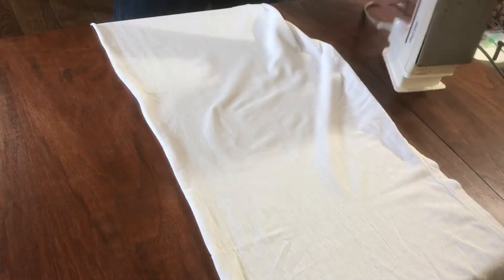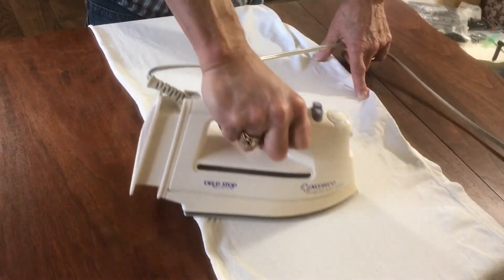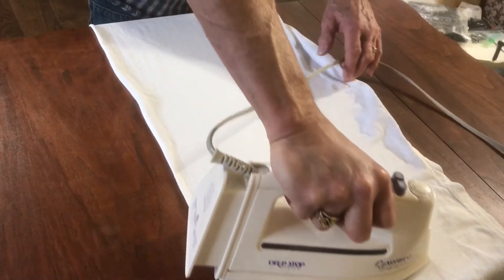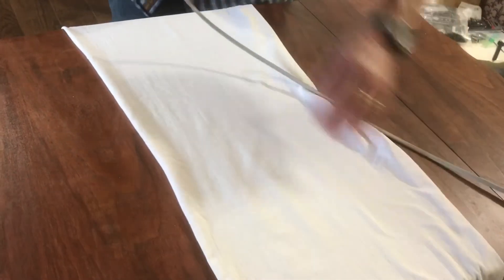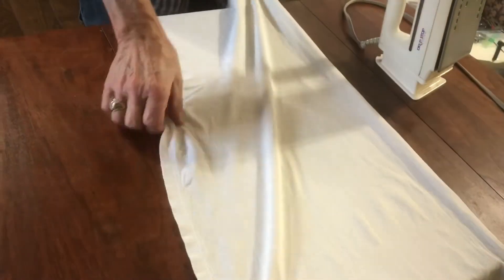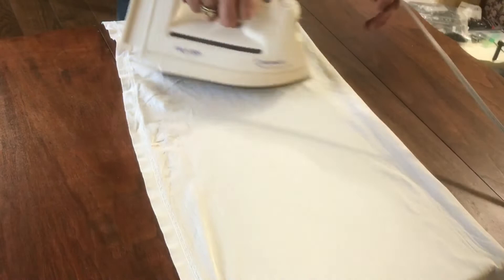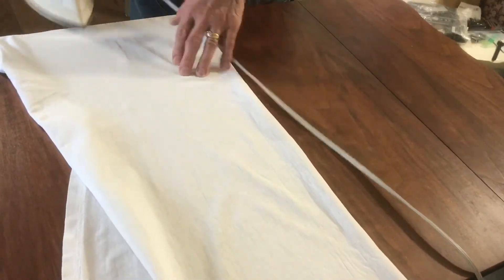So this particular finish can't withstand the heat as much, so I'm going to pick up the speed a little bit. I don't want to remove the finish off this table and have to restain the whole thing — I'm just trying to pull those watermarks out. It's still sticking a little bit, so I'm going to make fewer passes but speed up. There's also a water ring spot up here close to me, and it's already started to lift a little bit. That's about all I'm going to do on this table, and then I'm going to put some lemon oil on it. You can see it's pretty well gone.